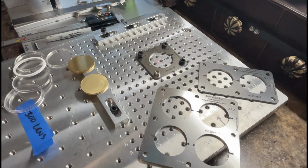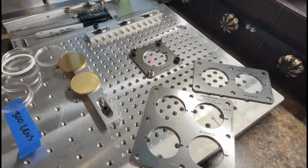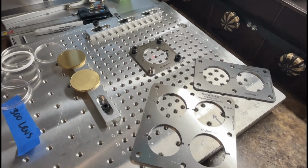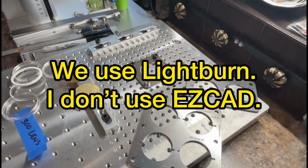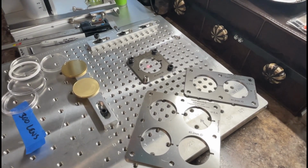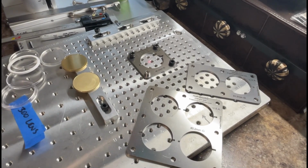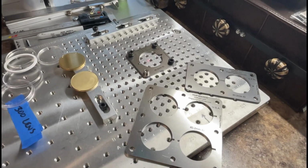Anytime you use a template with a jig to reproduce your designs, you have to initially position it using the laser software. You cannot just bolt the jig to your bed and have it ready. The laser's beds aren't built with the bolts perfectly aligned to your laser's beam. So here today I'll walk you through the process of placing the jig and setting up the template in LightBurn.